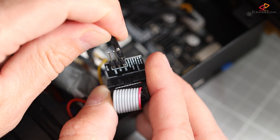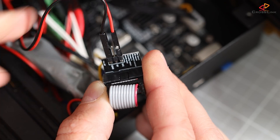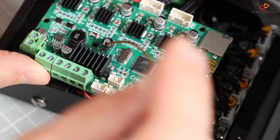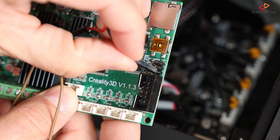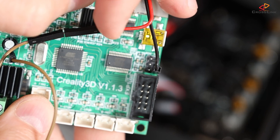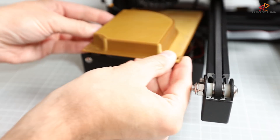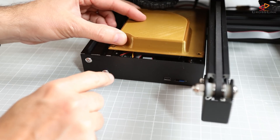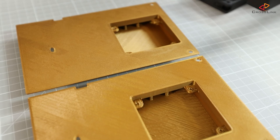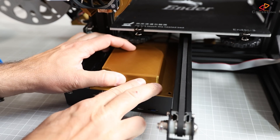In the case of the pin 27 adapter, you will have one of the sensor cables connected to pin 27 and the ground pin on the adapter. Or if you're using pin 29, you will find a free ground pin at the ICSP programming port — that's the lower right pin if you look at the mainboard with the SD card reader facing to the right. In this example I'm using pin 27. I also needed to remix the case cover I recommended in another video because the 60mm fan conflicted with the pin 27 adapter, so I moved the fan further back. I've linked this new version in the description.